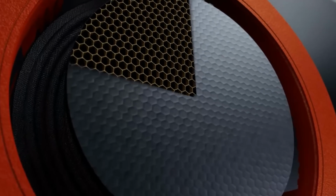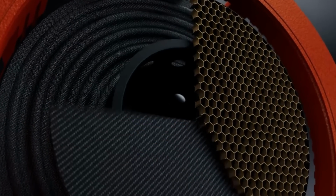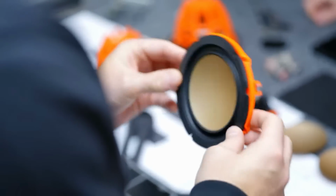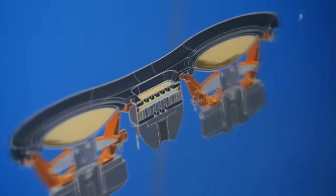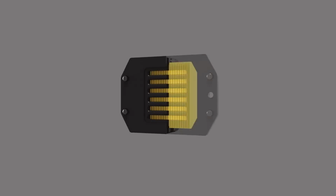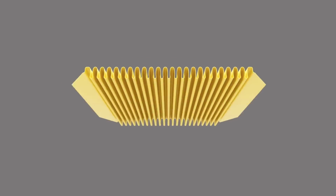The CCAM or ceramic coated aluminium magnesium outer skin sits over a Nomex honeycomb central core with a woven carbon fiber underskin, lightness and stiffness being the goal. I have another acronym for you, MPD. It stands for micro pleated diaphragm. Why they can't call it AMT eludes me, because the tweeter is an air motion transformer. I guess if you develop your own drivers, you're entitled to call them what you like.